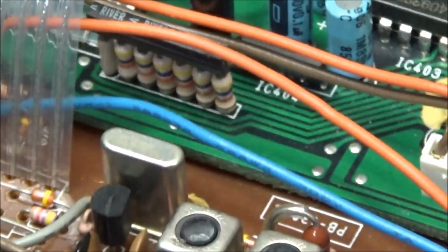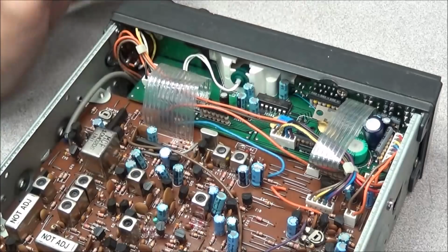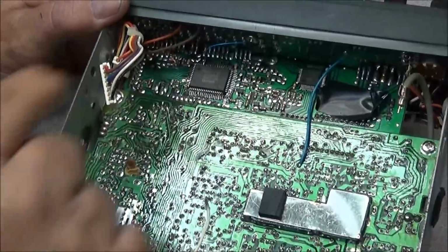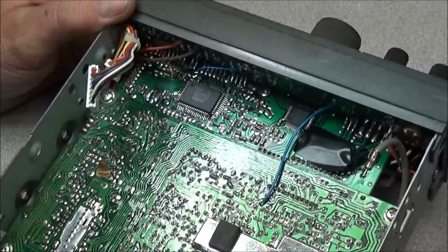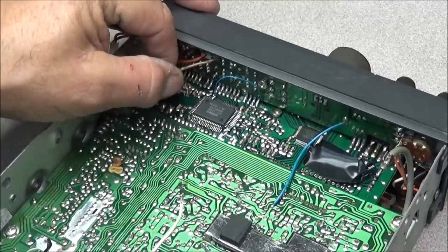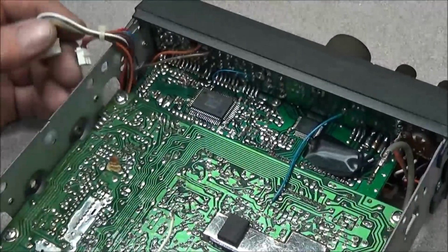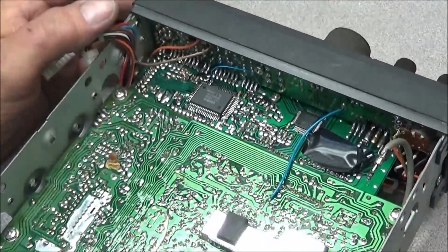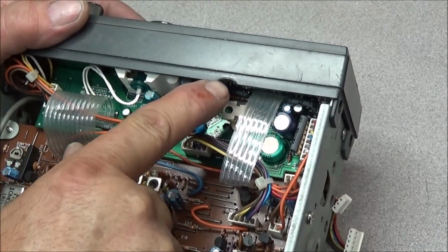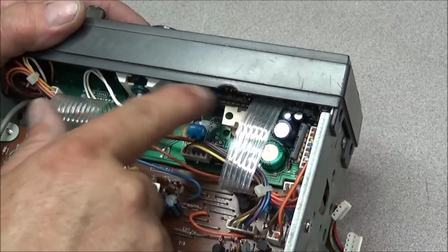At the moment, my suspicion is going to be either faulty capacitors or a fried CPU. That's pretty much a good estimate of what's going on here. Looking at it, I see these wires here have been burnt by a soldering iron. The case right here was burnt. Someone lifted this up and soldered the wire to it and just burnt the case.